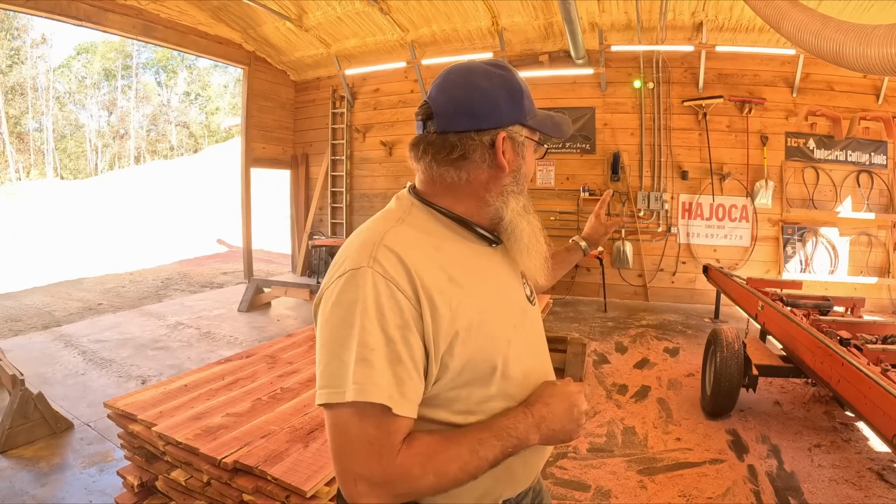This cedar can be a challenge sometimes just because of the odd shapes. Didn't say it before, but like always, we're running a Wood Mizer double hard turbo 7 blade. These are actually 45 thousandths. Get a little chatter in it, and that's because the blades are so old. I've got about 15 more, and when I go through them this time, I'm probably going to break them all and be done with them and start with 2 new packs I got over there.